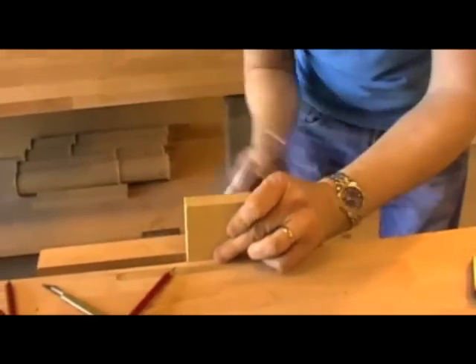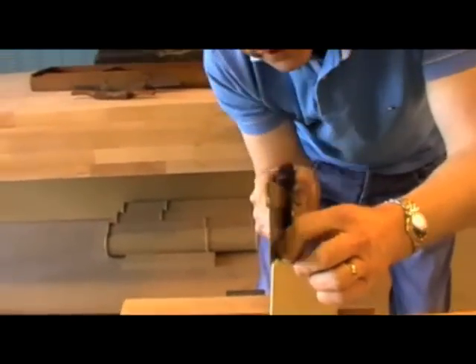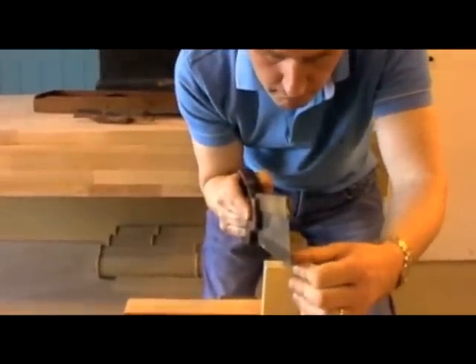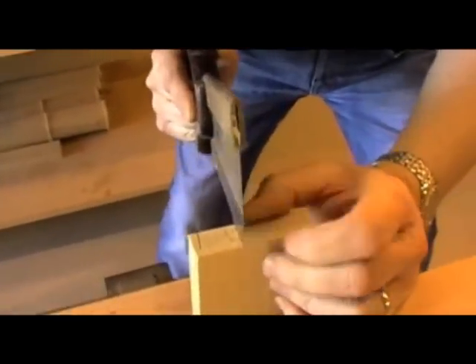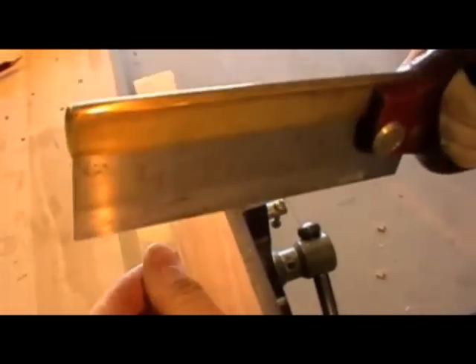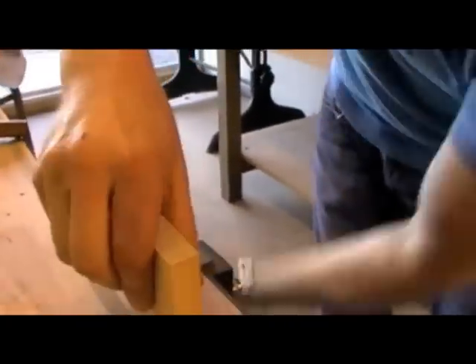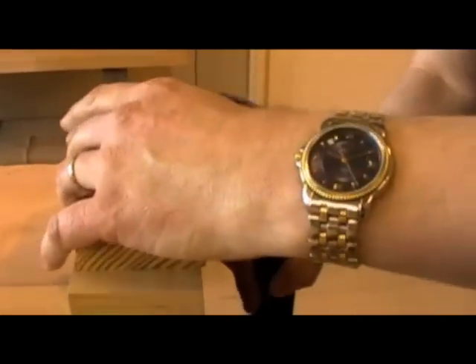Sockets off my tails. Put him in the vice, move my kit out of the way, and just put him on the waste side of those lines. Be careful not to go over the gauge line — either on the inside or on the end of the timber. Take this timber out of the vice now, cramp him down the table. I'm going to be chopping with my beveled chisels to remove the waste. This is the bit that starts getting a bit more fiddly.